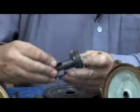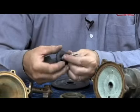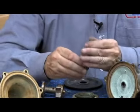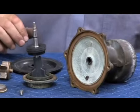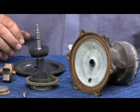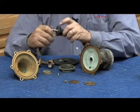Same two-piece construction. That was kind of expensive to make, so the final design that they made is this one, where the stem was one-piece stainless, where they actually machined that stop in the top, two-piece plastic, quad ring, stainless on the top, plastic here. After they got that far, they discontinued the model from production. So that's the 575 inch and a quarter through 2 inch relief valve stems that you may see on this particular design. You could have one of any of those stems.